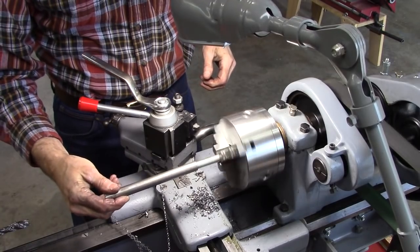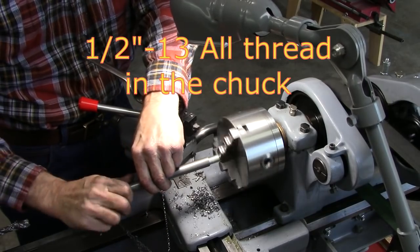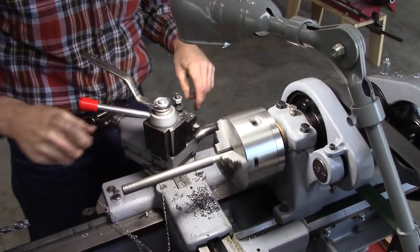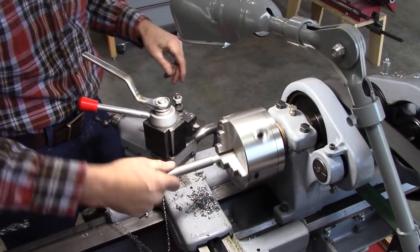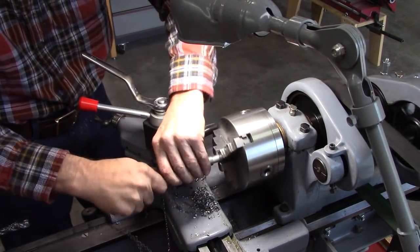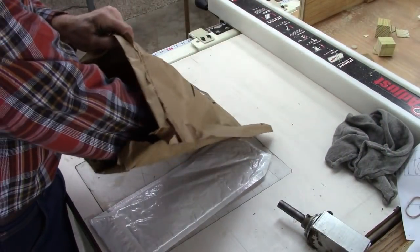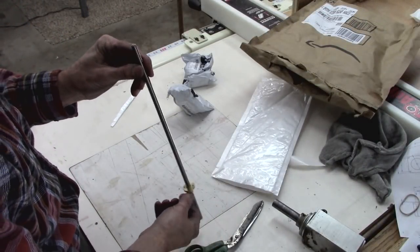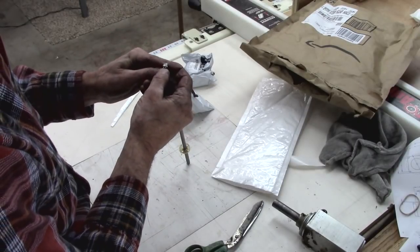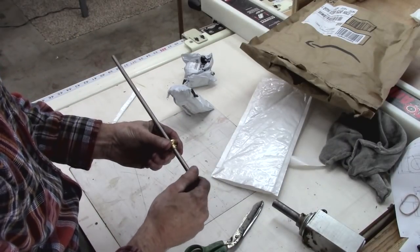I was going to turn down the end of the lead screw, but it was flopping around on the outboard side of my lathe, so I thought I'll just make a coupler. Let's see how true this runs when I screw this on — oh, that's pretty good. I'll probably loctite that to the end of my lead screw, or I guess I could pin it. Probably needs to be pinned. Let's see what I got in the mail. That's my cross slide lead screw that was supposed to be single start, and it's four start — that is one fast moving cross slide.